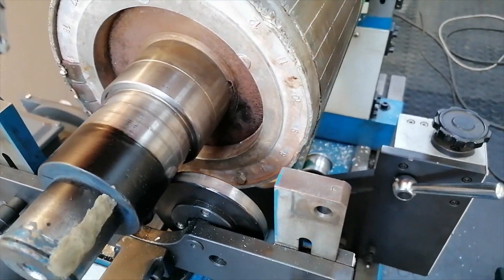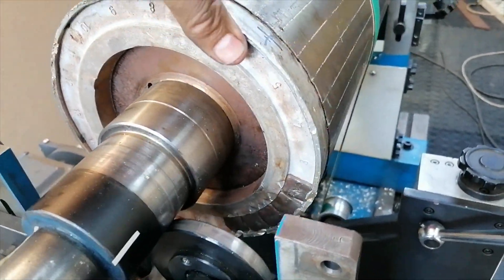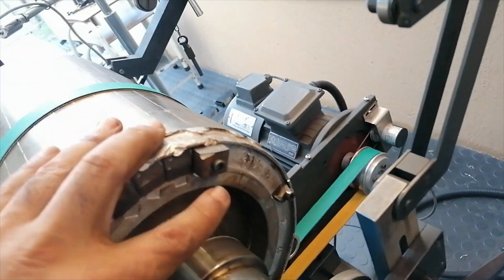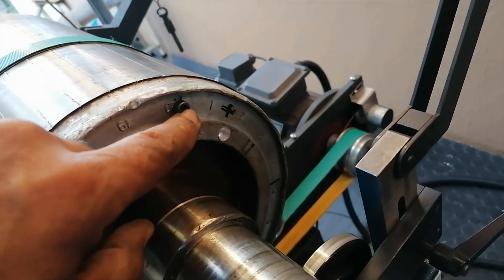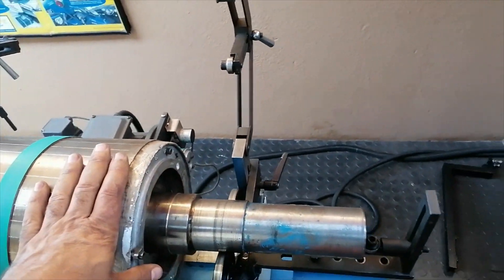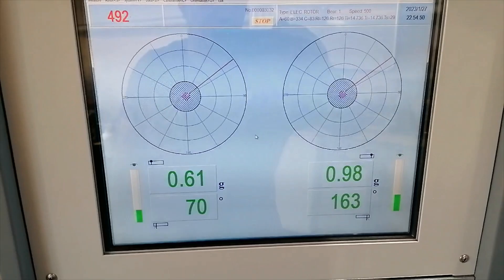With numerous attempts: I drilled a hole there as you can see, then mounted a bolt to add weight on this side. I added this weight here, which I had to grind a little bit, and added that bolt and drilled there. This thing was actually quite out of balance - I'm not surprised she ran hot. It's all below 1 gram now, which is cool. I've printed it and I'll show you the printout.